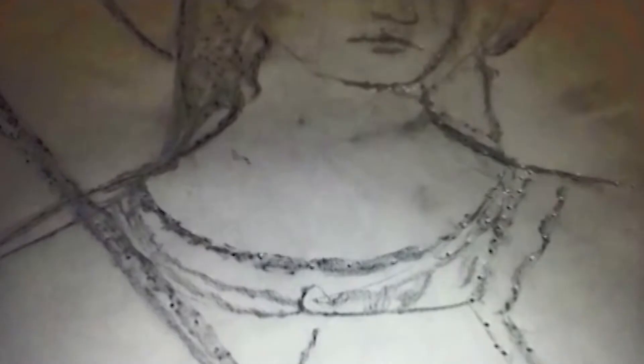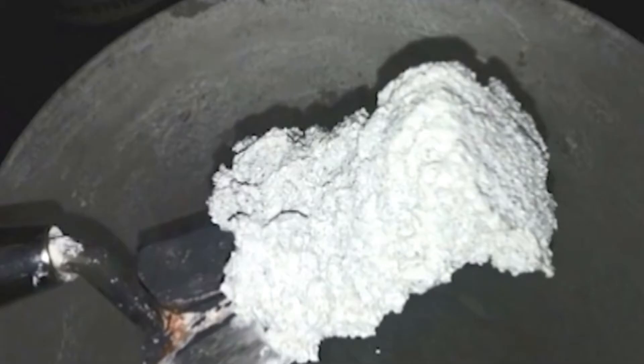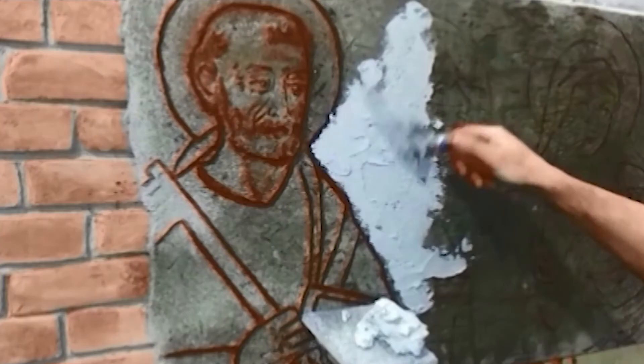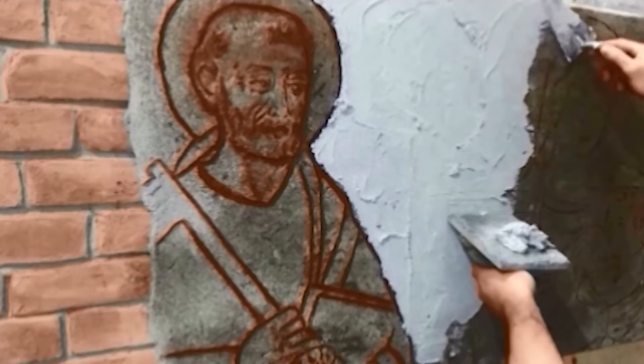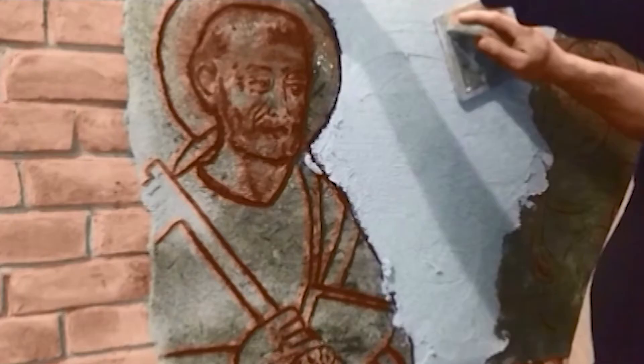Great attention to the selection of ingredients and the preparation of the mortar in previous days, as well as the ability to spread the plaster evenly, are elements as important as the painting itself. After wetting the wall to saturation, this last layer of mortar is laid on and painted before it hardens, guaranteeing the properties of brightness and resistance typical of fresco. Be careful not to leave air bubbles and maintain constant flatness during work using wooden slats or a wood float.